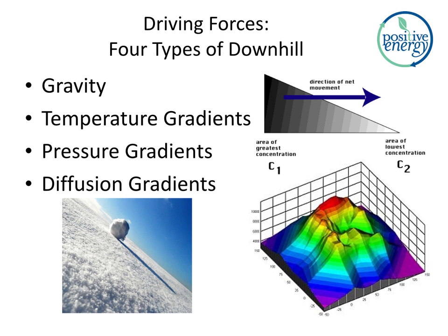You see that color-coded mountain, that topo map down the lower right? Downhill is from red to purple. So heat flows downhill. If that was a pressure map, pressures would equalize by moving from high to low. Same thing with diffusion. Areas of high water vapor concentration will move to low water vapor concentration. So these are the driving forces. Again, they are always present. So control layers are always going to leak. They're always going to leak a little bit. We're not building the space shuttle here.